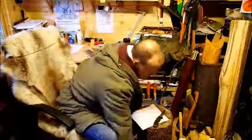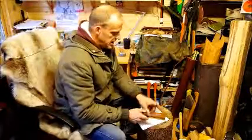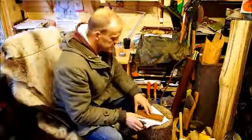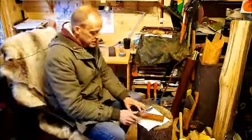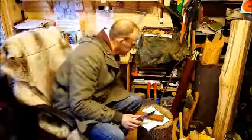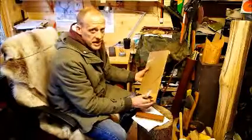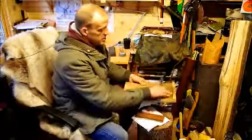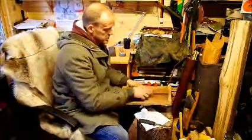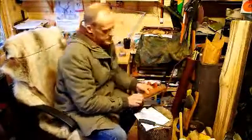So obviously, because we're on a bench or a block, we can have something a little bit bigger. So the water stone's a decent size, and my stump here has got a bit of a lip on it which can kind of help keep the stone in place if it's slipping around. If you are having a problem with your stone, you're using it on a flat surface and it's sliding, a good way to prevent that being an issue is to simply make a sharpening base. So I've got a big lip here to catch on the edge of a table or a worktop, and a thinner lip here to catch the stone, and obviously then the stone can just sit on there and I can push away and it won't move anywhere. It doesn't work on the stump because it's too narrow, but for flat surfaces and tables that's ideal.